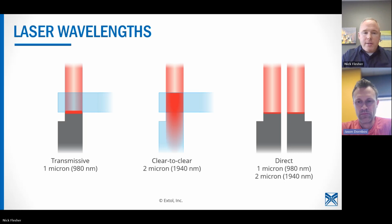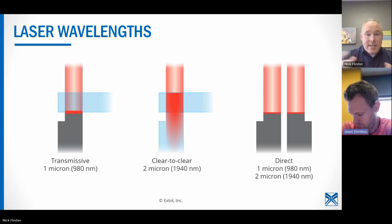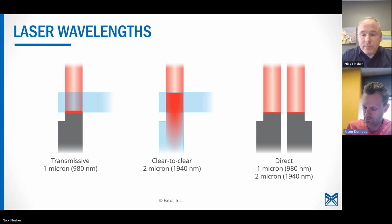If you're sitting there thinking, I've got a little bit of glass content, maybe a PA 12 with 30% glass, how does that affect it? The answer is it does. It means that the designs need to be a little thinner, and the glass content needs to be pretty homogeneous, evenly mixed. If you have a glass concentration in one corner, you hit glass with fibers going all different directions. It takes that light and disperses it everywhere, so you might get a cold spot in the weld.